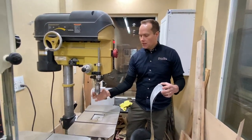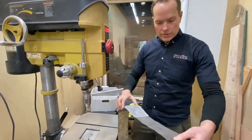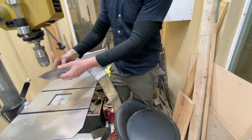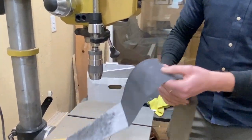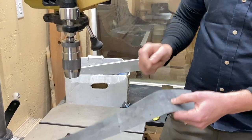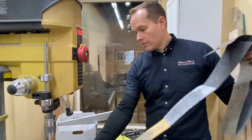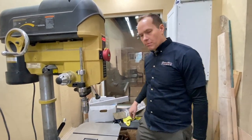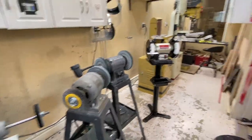We put the bolts in the drill press, and then with the drill press running, we start. All of these are the different grits of sandpaper, and we just start with the 80, and then move it all along, all the way to 2,000, and that gets it pretty good. And then the final step is to buff it on the buffing wheel, which makes it absolutely polished perfect.